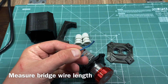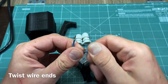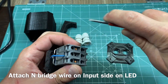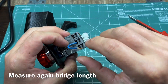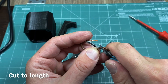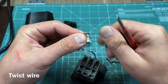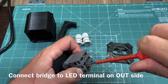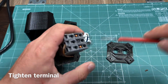Connecting the light indicator is pretty straightforward. You will just need two short jumper wires. For consistency, better use the same wires all around and maintain the color coding. First we make a short jumper wire for the neutral part of the indicator and put it in the input side — you will connect to the neutral wire leading to your main outlet on the input. In the same fashion we prepare a short jumper wire for the live line: strip one end, measure, bend in the middle, strip the other, twist the wires and connect to the corresponding terminal. This wire will be connecting on the other side of the switch so the light works only when the switch is in the on position, connected to the second switch which will be terminating the phase line.